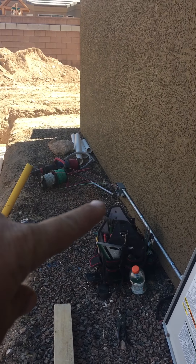This is my third time taking it so I'm not gonna get all fancy with it. I'm trying to put enough room so you can see everything. Double 20 each breaker — this is 110, this is 220. 220 is linked. Everything's run off 110, and I'm showing you that because of your relays.